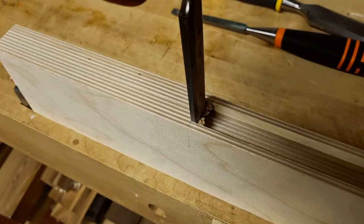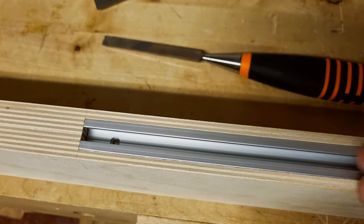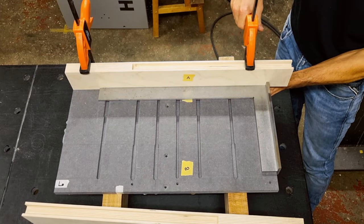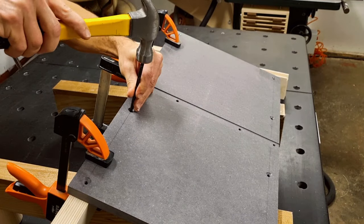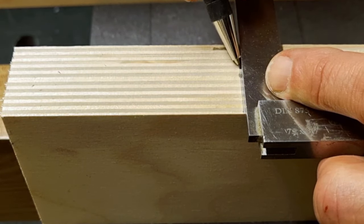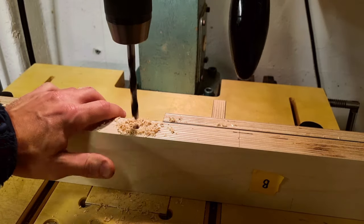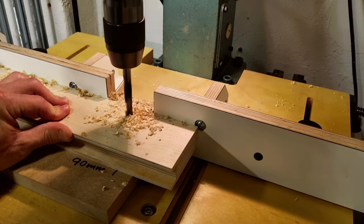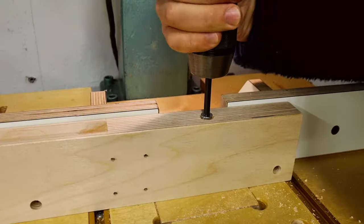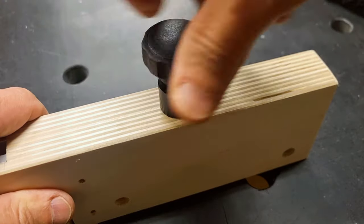After the router table I clean up the corners with a chisel. To lay out the holes in my fences I use a square against the base plate, clamp the fence in place, and use the center punchers to transfer the holes. I then drill the screw holes as well as the cross dowel holes, and also drill a hole for a threaded insert. This insert is the parking spot for the threaded knob I showed in the intro — it's used for stopping the sled's forward motion.